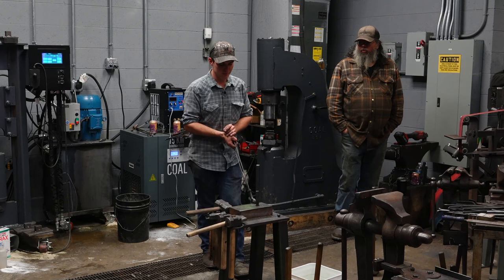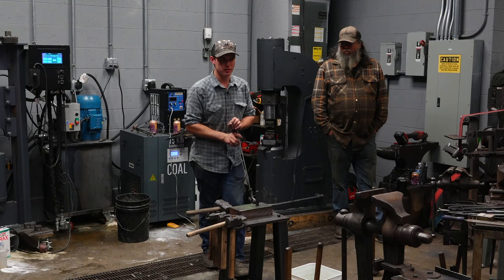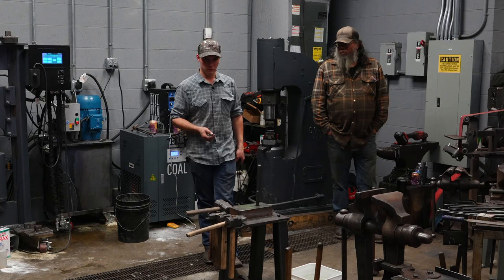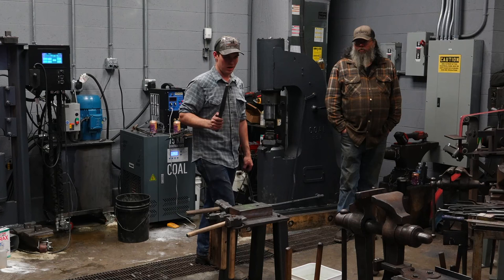They work great, there's just a little more wear on your tools and it's very expensive, like many times the price of 4140. The drifts I use for production forging are S7 and they last a very long time compared to something like a 5160 drift or a 4140 drift. But that's comparing them under a power hammer. If you do things right with a striker, it takes a lot to destroy a drift. But under a power hammer, I can destroy this instantly if it's in a tool.